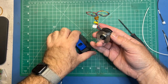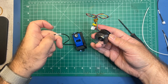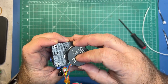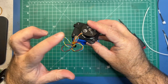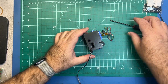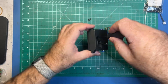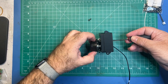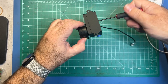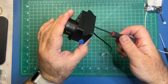Find your stepper motor and make sure your number matches the number here — I'm on number one. When you install this, set it right here and make sure the wire is angled towards your tensioner screw. Flip this over, drop an M3x8 into this hole, make sure the screw comes through, then align it like we had it earlier and get that screw set. It should come together pretty easily. Make sure you're making contact with the gear.